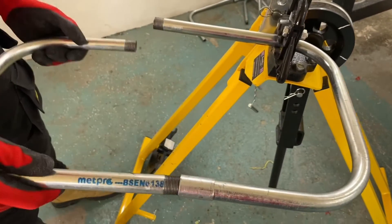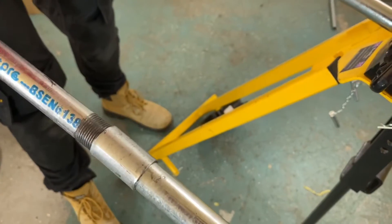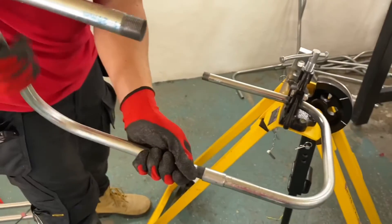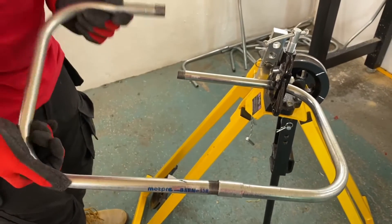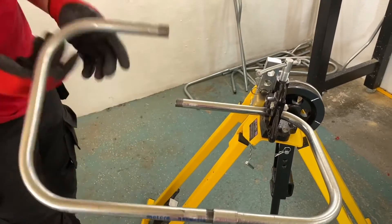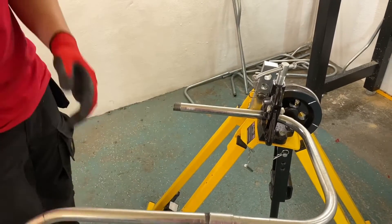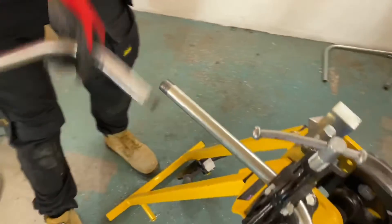So we'll spin this on and we'll see the problem that we faced. This is what I did wrong — I put this coupler on nice and tight and I spun the other piece of conduit on and then there's a bit of an issue. That spins round and obviously the two pieces of conduit will clash, so you couldn't spin two couplers on at the same time.